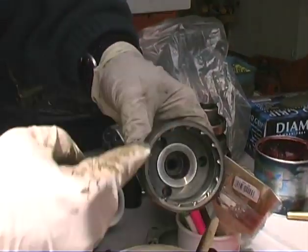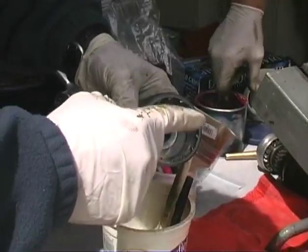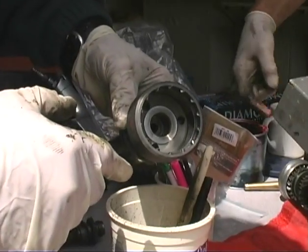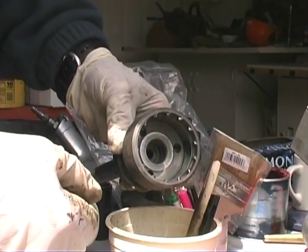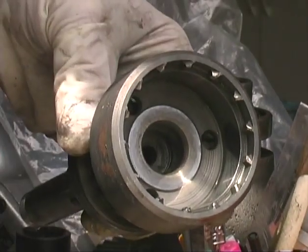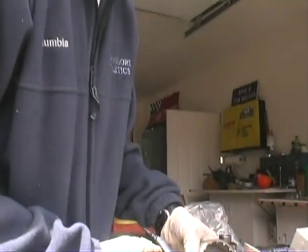This shaft here, the end here, is where the freewheel assembly goes, and every transmission I've taken apart, for some reason, a lot of crud and filings just totally collects in this area. And I know on a couple of my cars, sometimes I like the freewheel, I will say that. I think it's a great, unique feature for the cars, even the V4s. But sometimes you'll take off from a stop, put it in first and let the clutch out, and nothing happens. And it's because the freewheel assembly is all sticky with crud inside there. So it's important to clean this whole thing out, because that's where a lot of it collects over time.